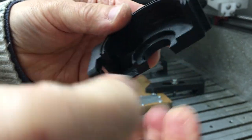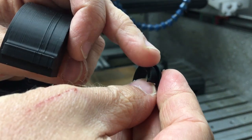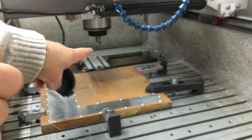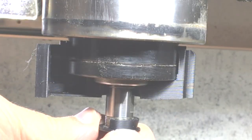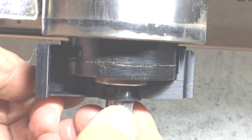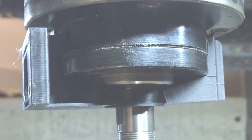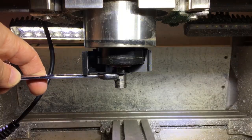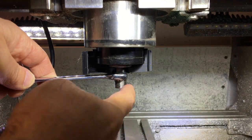I've just made this little cutaway model just so you can see what's going on, and also to allow me to fine-tune the exact height so that it's just touching the locknut at the bottom there. And we can just about get the 13mm spanner on to change the end mills in the collet.